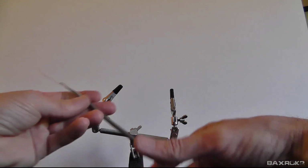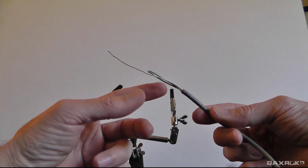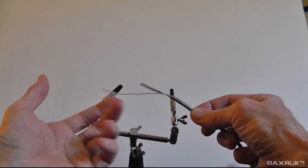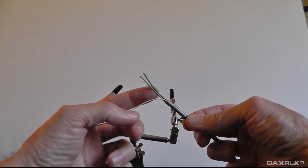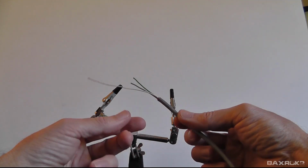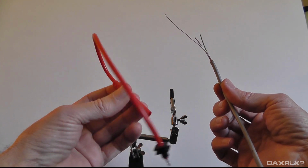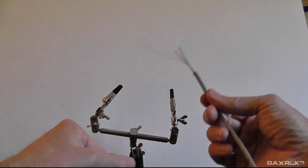And then unfortunately, I have this lousy cable here that I sort of found lying around. It's shielded, it's got 5 conductors in it. I'm using 3, so I'll use power and ground. And then this will be my signal wire. So that's basically the setup. I've got the connector, the 4-millimeter signal wire lead that goes to one of the channels on the tool. And then I've got the wire here.